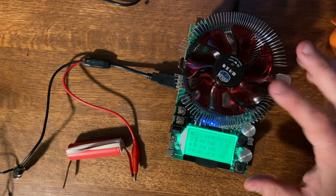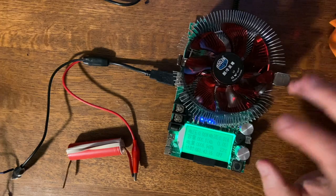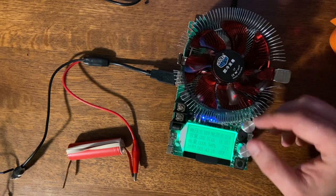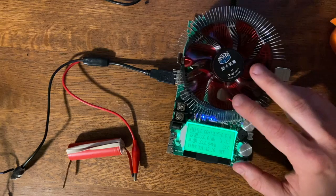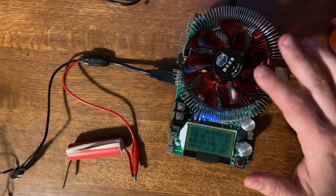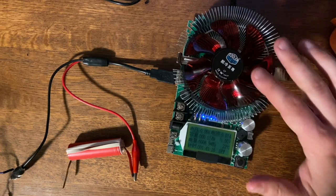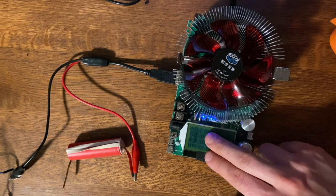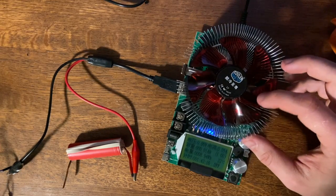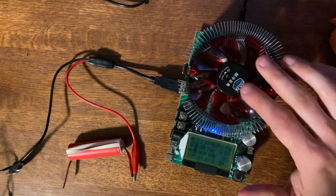This works pretty well — it's really straightforward, not complicated to use, and pretty affordable. It has everything you want right on board. What's not to like? Well, as we saw, the voltage measurement isn't really accurate. It's not a huge deal, but you're going to have to monitor it: if you want to cut off at 3 volts you might have to stop at 2.7, and if you want to stop at 12 volts you might have to set it to 11.7. To eke out that last 5-10% of your battery, you'll need to monitor it and continue lowering the low voltage disconnect. My voltage reads a little low, but you could get a model that reads a little high.